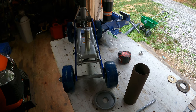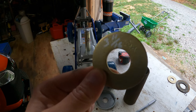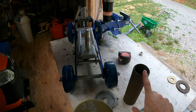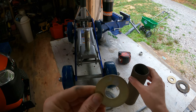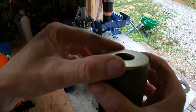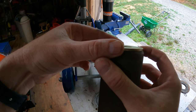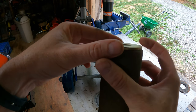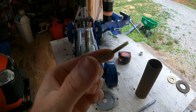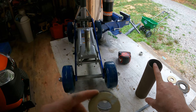With my highly accurate measuring device I come up with 3 and 11/16 inches for the overall length of the spacer. That's going to probably include the thickness of the washer, because it won't fit down in the pipe to weld it — so I'm going to have to bevel it and weld it on the top edge. We'll have to take into account the thickness of the washers, so let's cut the pipe, weld the washers on, and get this thing together.